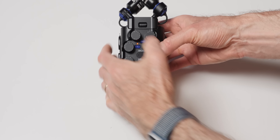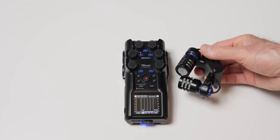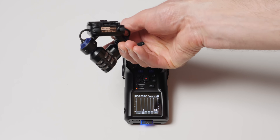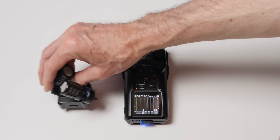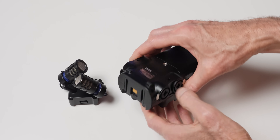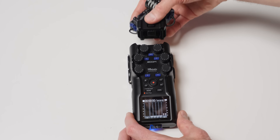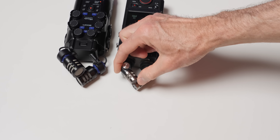You can also normalize it if you want to export that way. The XY stereo mics have a dynamic range of 123 decibels, compared to the original Zoom H6 which had a dynamic range of 65 decibels — almost twice the dynamic range, pretty amazing. The max sound pressure level these mics can handle is 140 dB SPL, which is good for recording really loud things. So if you want to record a loud concert using just the built-in microphones, you should be just fine. I would say these are probably the best sounding microphones on a handy-style recorder that I've used — better than any previous Zoom H series, and I think better than the Tascam Porta Capture series as well, though the Tascam actually sounds good but is noisy.